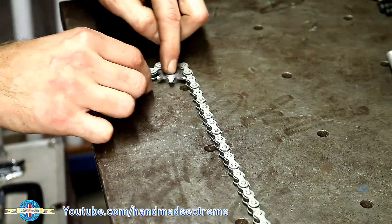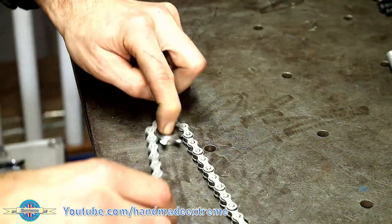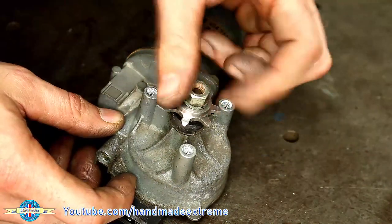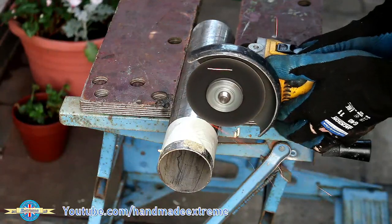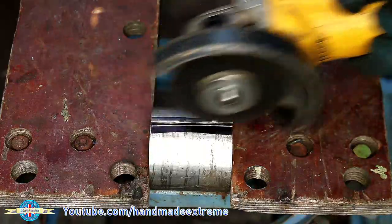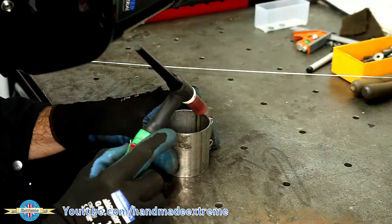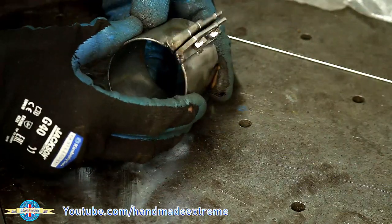To test it I just put the chain on the bench and rolled the gear along back and forwards, just making sure there weren't any tight spots. I could then put it on the motor and it goes on with a little spring washer and a nut. To hold the motor in place I wanted to make a sort of spring clamp, so I got a little bit of exhaust pipe, cut it to length, split it along its length, drilled a few holes in some bits of stainless steel angle, and made some little slotted holes for some bolts. I could then tack that together with a couple of short stitch welds — and there's our little spring clamp to hold the motor in place.